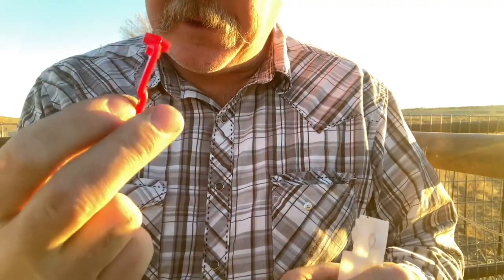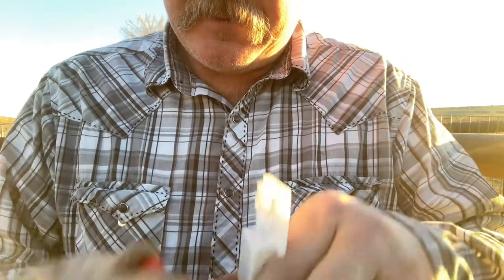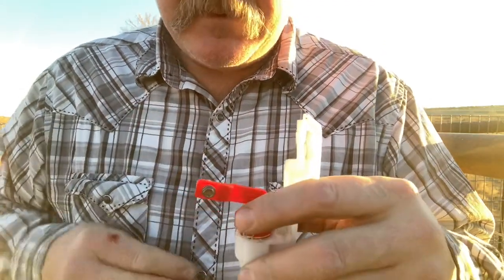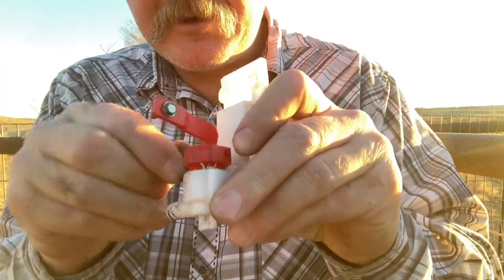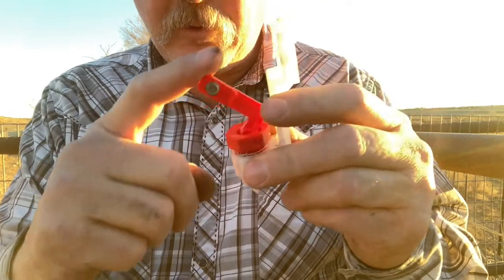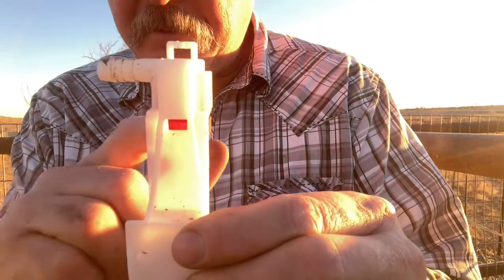This time I figured it out. I took the arm off first, threaded the valve body base into the holder, dropped the rubber gasket in there, that thing just sticks in there, and then there's this little plastic pin — you just shove that in there and it kind of snaps into place. That's how the float works. Next time this happens I think I can just push that pin out and replace the valve stopper without monkeying around with all this.